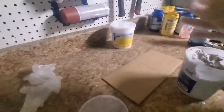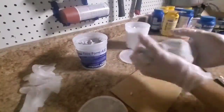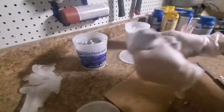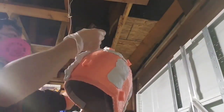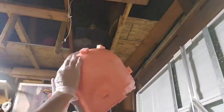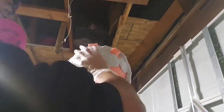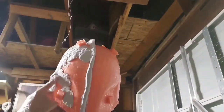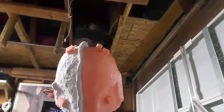You just take out two even amounts and mix them together like dough. I look at the cups, compare them, and that's just how I do it. From there, I just mix it together as fast as I can. Once I think the dough is mixed properly, I start spacing out where I'm going to put it. The big thing I had to do first was make the separator for this mold — that was that line you see right there of dough. I used a knife to carefully remove the material on one side, then used that material for the rest of the shell on the other side of the helmet. I did run out of some material, but it wasn't a big deal, because I used only a third of the material and the rest of the mold is going to use that side.